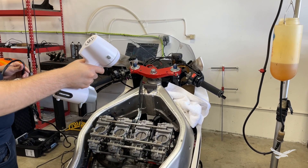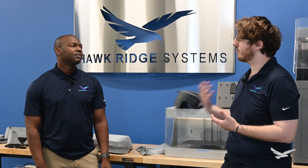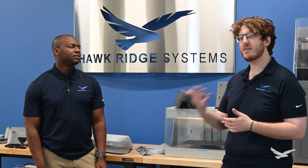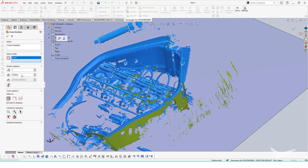This is a common issue we see with people trying to retrofit things — they take hand measurements, spend a long time, only to find a measurement is off. With the 3D scanner, in five minutes you gather all the data you need. Once you had the data, the next step was to take that raw 3D scan data and reverse engineer from it, creating reference bodies inside SolidWorks.